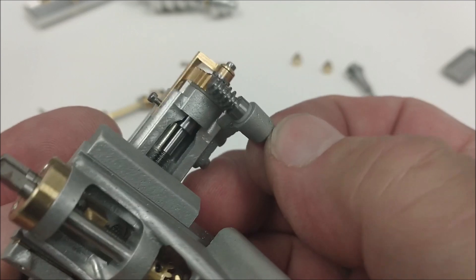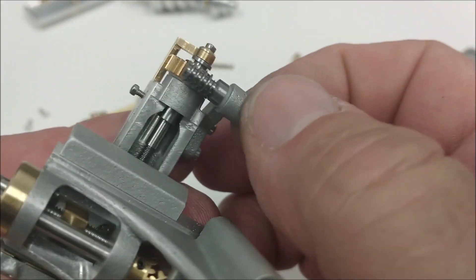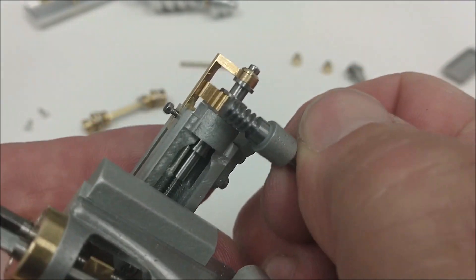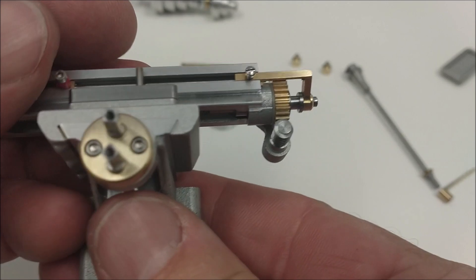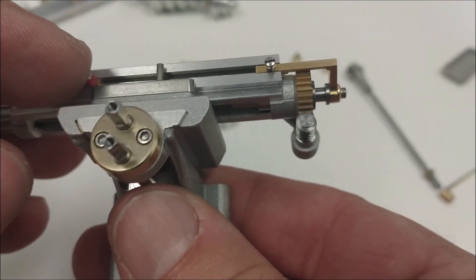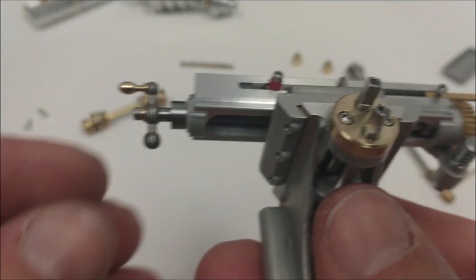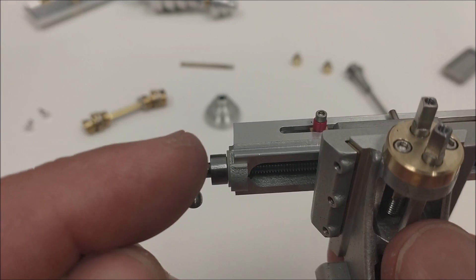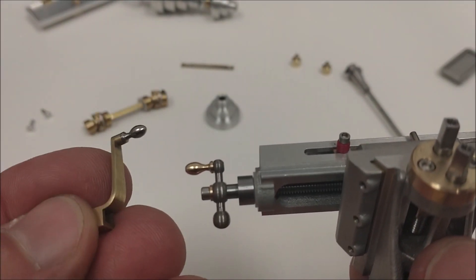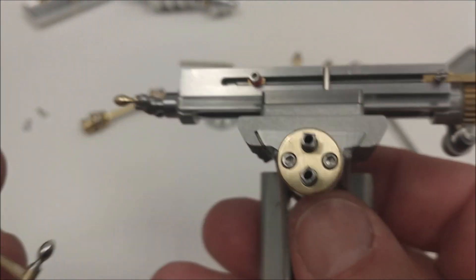The ratio here is so small — I'm going to try not to hit the camera with my thumb, so hang on. There it is. This is the way you engage and disengage the power feed for the table. For this particular model, I swapped out the steel and the brass, and the same thing with the crank — I went with steel on brass for both locations. Let me know in the comment line if you like the way that looks.